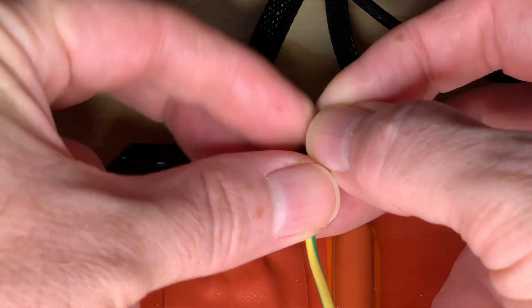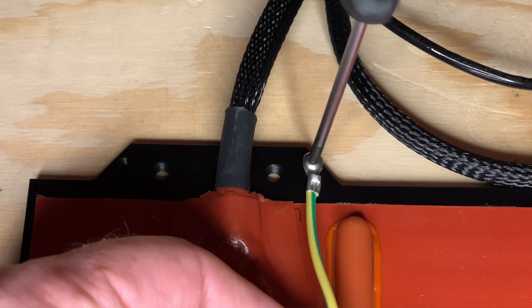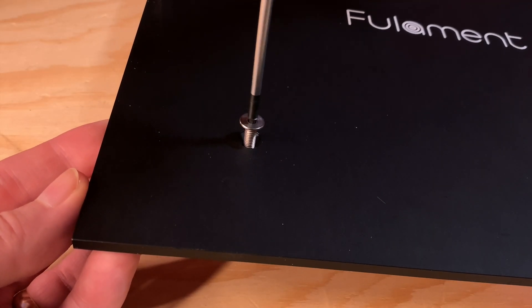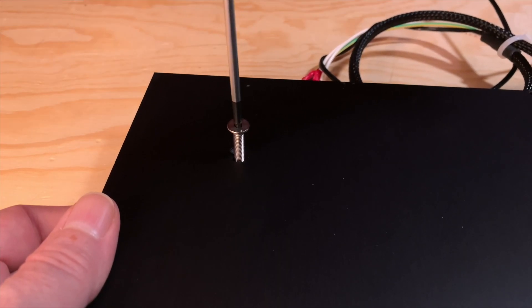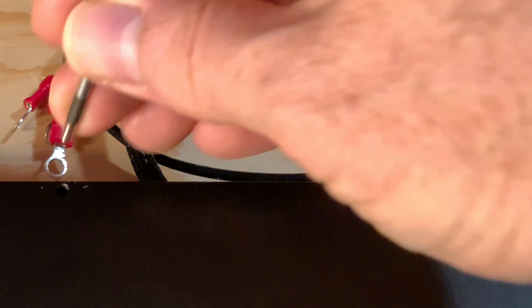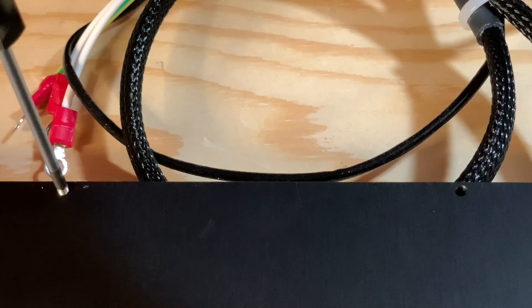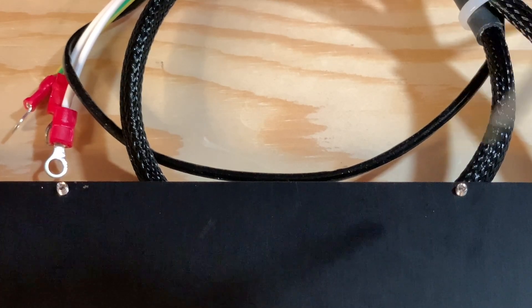Next, I attached the bed heater's grounding wire to the bed, held in place with a small screw included in the kit. Then I attached the four bed adjustment screws to the bed — these go in from the top side and just screw into place. They're countersunk, so they're intended to be flush with the top surface. The last step in preparing the Fullabed is to install the two alignment screws for the Fullaflex spring steel sheet. These are like little set screws, and they align the sheet at the back of the printer, making it easier to snap it back into place every time.